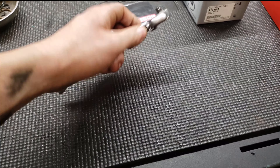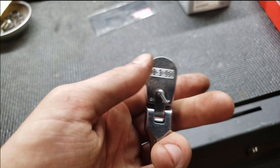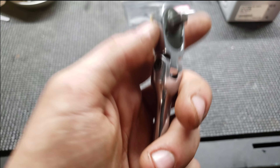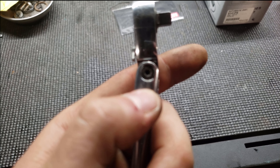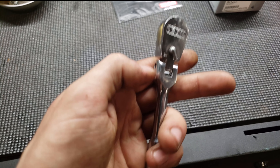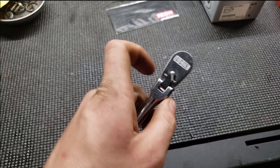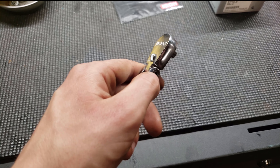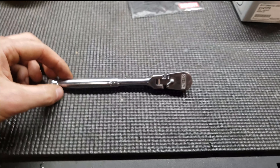As far as the flex head goes, I've had bad luck with some Harbor Freight flex heads — granted those are Pittsburgh's, not Icons. On the Pittsburgh ones, there's a torque screw that goes through the fork to secure the flex head, and it can come loose. When you go to torque on the ratchet it spreads the forks out, and then that screw either snaps or never returns to normal. I haven't had any of those issues with this ratchet.